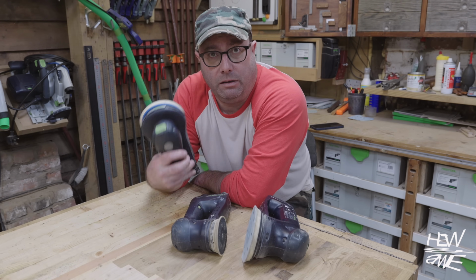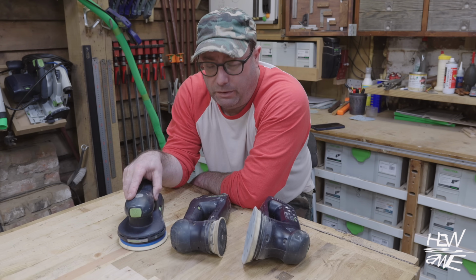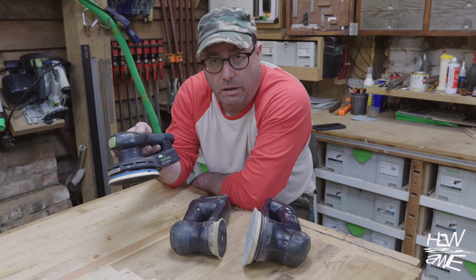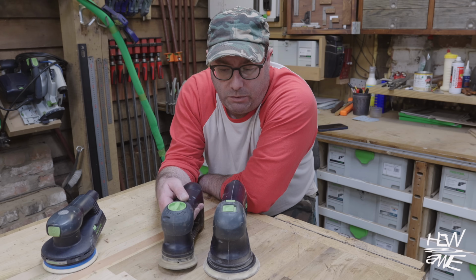This is my finishing sander because it's a 3mm stroke. Gets used the most. Mostly off the planer, I can just go straight to 180 grit on this, finish in 220. Job done. Variable speed. Somehow it knows when the dust extraction hose is connected to it or not. You can change these pads to different softness and hardness. These both have 2 different modes.